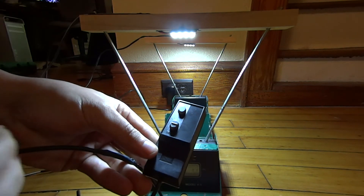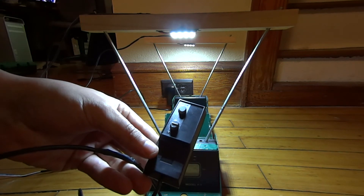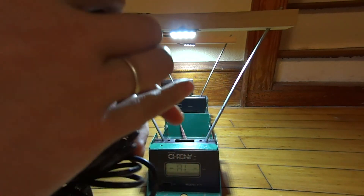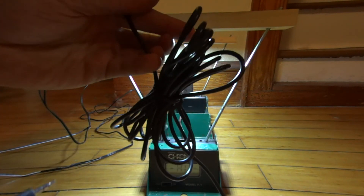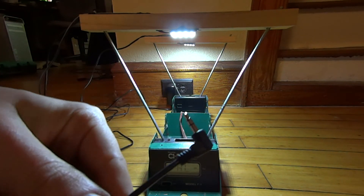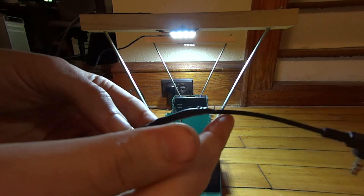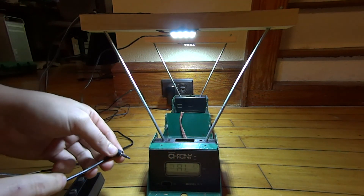You can use anything you want. You can go out and buy a momentary contact push button, or if you have some kind of momentary contact switch apparatus already laying around like this thing, you can go ahead and use that. Part of the reason I use this one is it has a ridiculously long cord, so I can plug this in and then stand quite a ways back where I'm shooting and still scroll through the menus. What you need is a momentary push button and a 3.5 millimeter headphone jack — that's what they use. I cut the line, soldered the two wires together, and yeah.